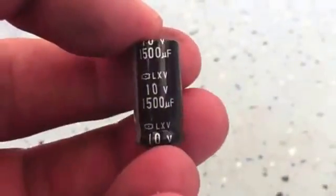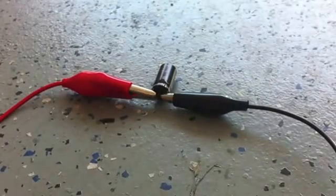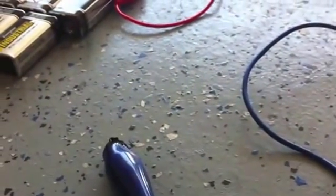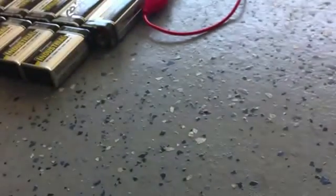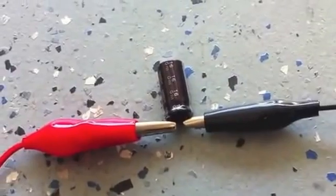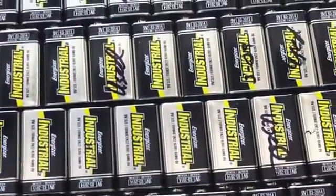Let's have some fun. Next we have a 1500 microfarad 10-volt capacitor — let's see what happens when it's overcharged. It's called arcing, and a lot of it. That gap is kind of fine. Let me check the leads aren't touching — they are not, I am impressed. Let's put some backwards voltage in it. I'm going to show you the Rice Krispie effect — there's so much voltage it'll arc and you can hear it pop.